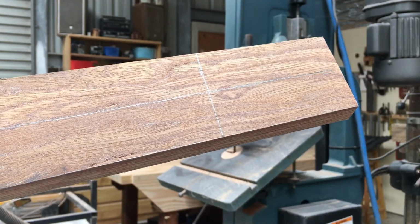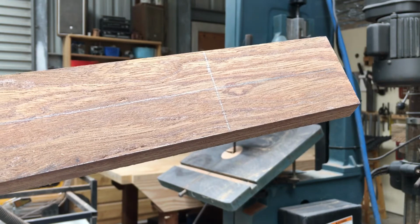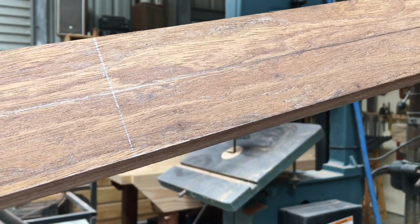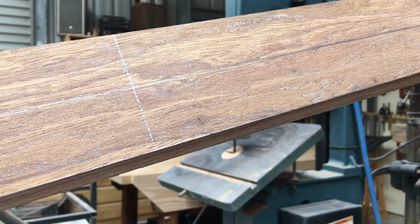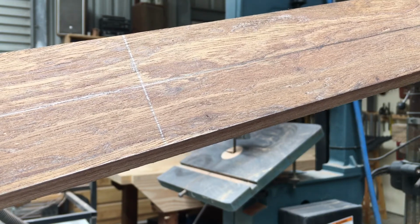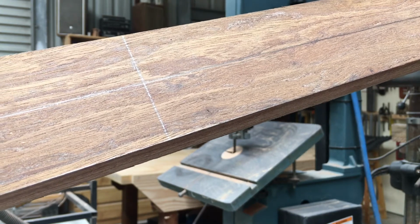Right, on the first cut line we need two cuts at 30 degrees. That's for the top portion to the neck. On the second cut line we do one at 30 degrees, which gives us our angle from the base to the riser, and leaves a sloping front on the actual base. Could do this on all the sides. I might do that yet. See how we feel.